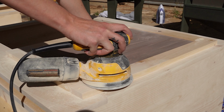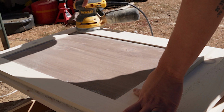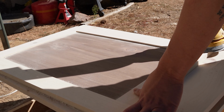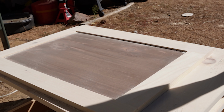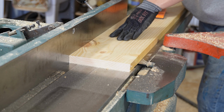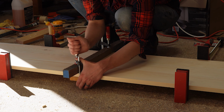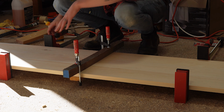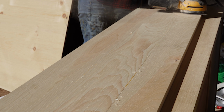Then gave the rails and stiles a finishing level sand down. And added these to the temporarily abandoned pieces of the project for the next and largest element, the upper bookshelf. After yet another round of squaring and laminating, this time creating 3 long side panels and 4 top and bottom panels, I again cut all the laminated panels down to size before giving them a rough sand down.